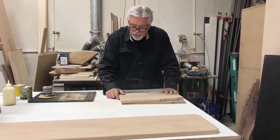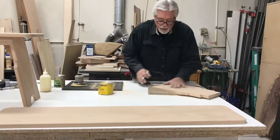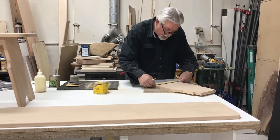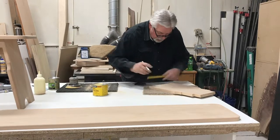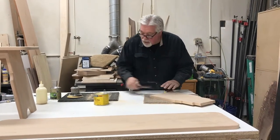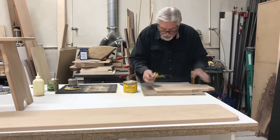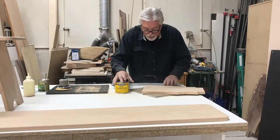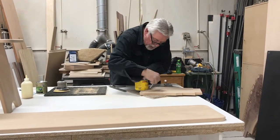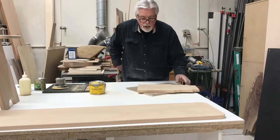To make our half circle at the bottom, we're going to use another high-tech jig — another can. We've got to center it. We're 10 and 1 eighth inches wide, so that's 5 and 1/16. We'll mark that and give us a center line. Our can is 4 and 1 quarter, so our radius is 2 and 1 eighth. That tells us where to place our half circle jig. We'll cut it out with a jigsaw and finish it on the sander.